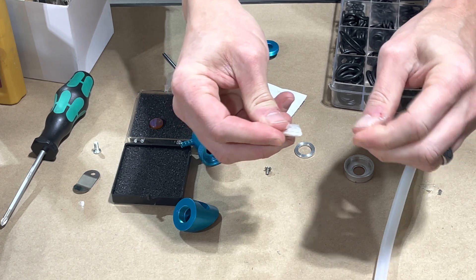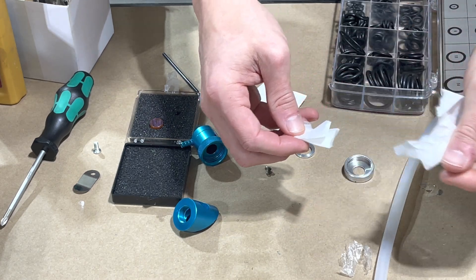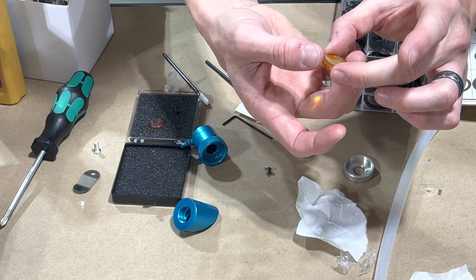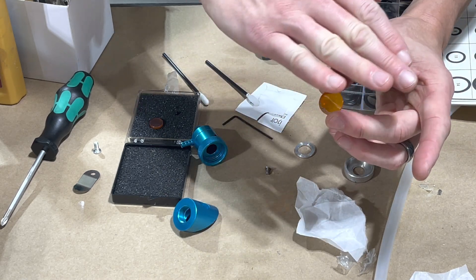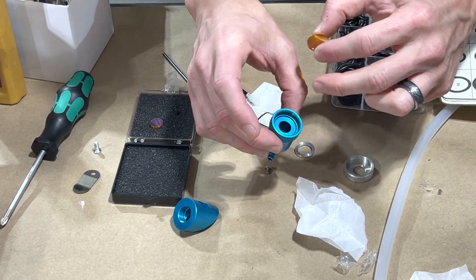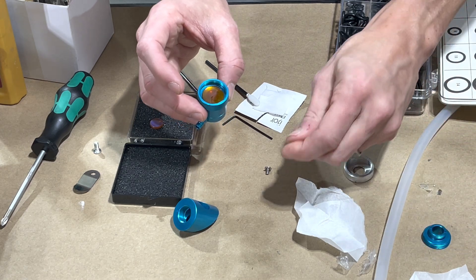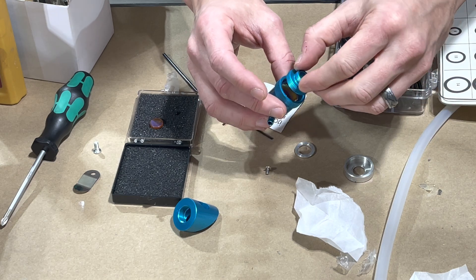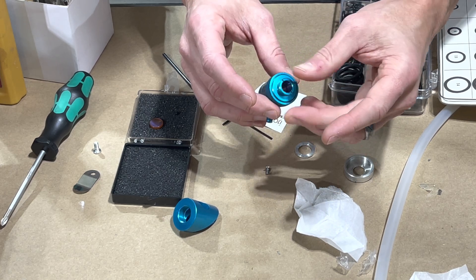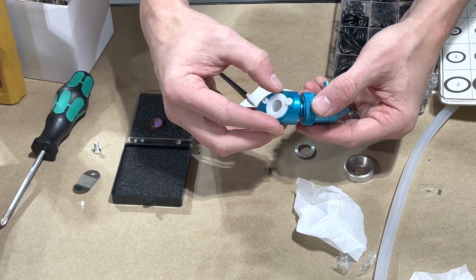We'll install the new 18mm lens, which runs about $24 — about the same price as the laser head itself. If you're on a budget just use the original, but if you want something nicer, note that one side is curved up and the other curved down. You want the concave side down. Remove the silver spacer ring, leave the lens in there, and screw the blue retainer cap back on. There is a neoprene washer you can put in to keep the metal from pushing directly against the lens, though the contact area isn't part of the lens that gets used.